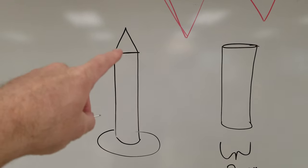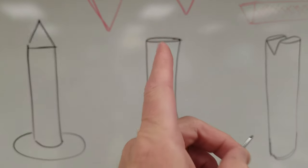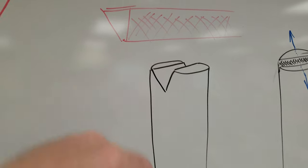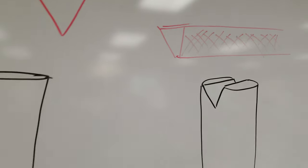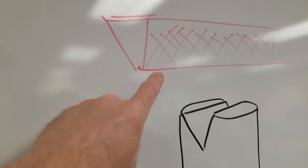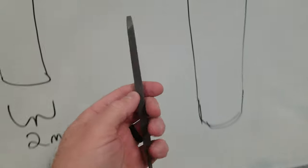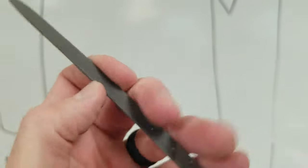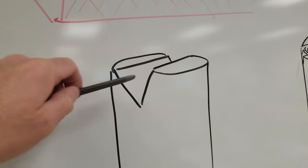Here's how to quickly turn a regular nail into one of these sewing needles. First, take a pair of cutters and cut both ends off until you have something like this. Then you're going to make a cut right along the top edge — here's a triangle file. You can use any shape; this is a small one, this is a big one. The shape is always the same; the only difference is on this edge — if it's a big file it may not cut along that edge. The smaller the file the easier it is to cut.